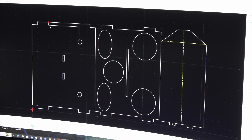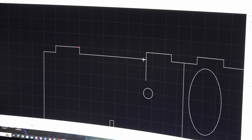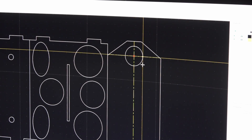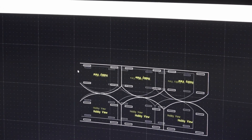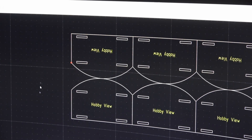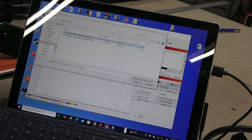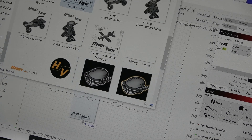After not much time and some online help documents, I was homing in on the complete design. Trim tools make removing unwanted lines super easy. I could also copy shapes to save time and use temporary center lines to align shapes. Copy-pasting came in real handy to clone parts. Note the text is a different color, and there's a reason for that I'll explain later. Be sure to save the drawing as a .dxf file, which is then imported into the LightBurn software. LightBurn also allows importation of graphics images like .jpg and .gif.